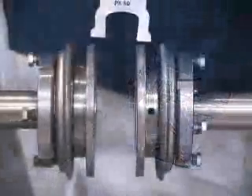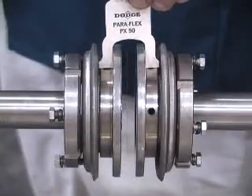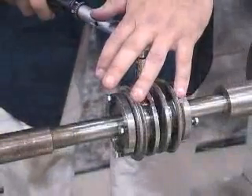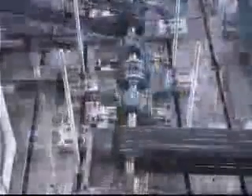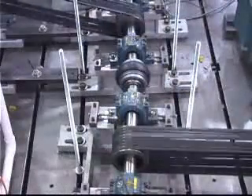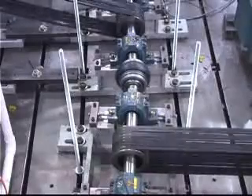The spacing should be set to the dimension listed in the instruction manual. The spacing template included with the element can be used to facilitate this measurement. Using a torque wrench, the set screws should then be tightened to the torque recommended in the Paraflex Coupling Instruction Manual. The Paraflex G-Series Coupling can accommodate an industry-leading four-degree angular and one-eighth inch parallel misalignment, in addition to five-sixteenths inch of end float. However, it is best practice to align the shafts as close as possible.